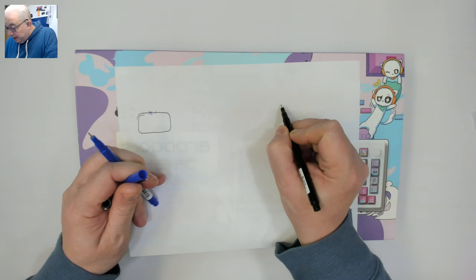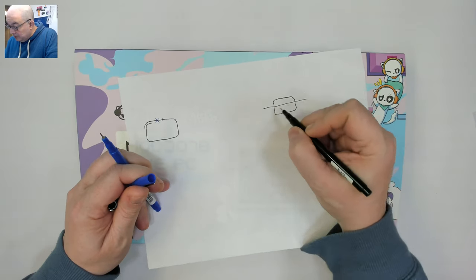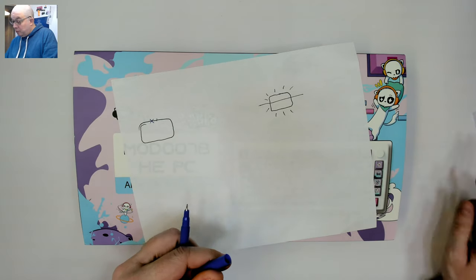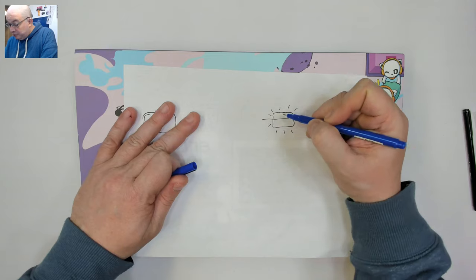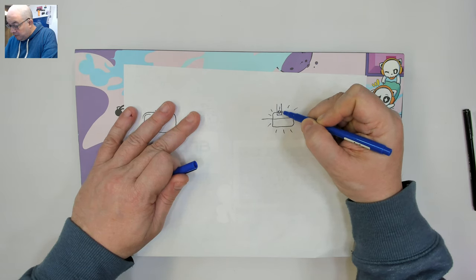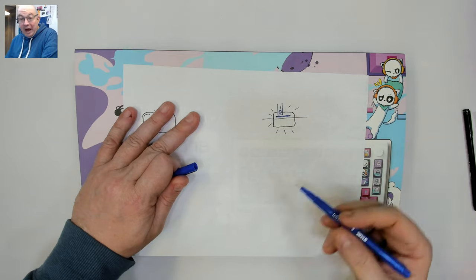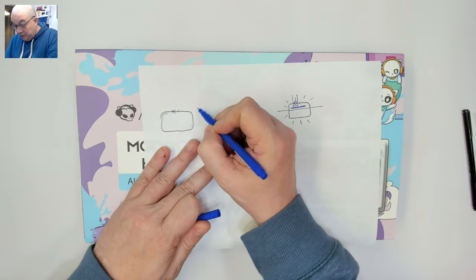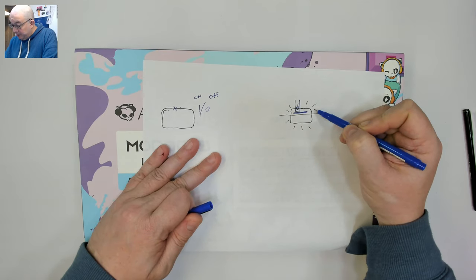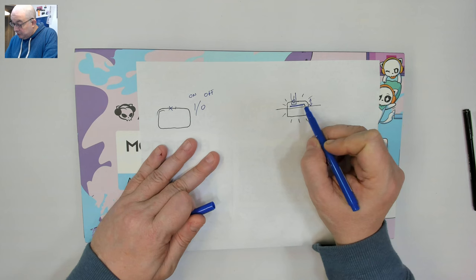Now, within a Hall Effect, we basically, again, have the keyboard generate a magnetic field around each key. Let's say this is the PCB, and this is the magnetic field that it's generating. Well, the Hall Effect says that when you bring a magnet into this magnetic field, it's going to affect it. So here's, let's say, the stem of the switch, which has a magnet in it. So it's going to change the voltage that's going on. And that allows, because this is actually an analog signal, where the other is either a 1 or a 0. It's either on or it's off. This actually changes. There's a scale of how many microvolts are going through here, and that can determine what position.